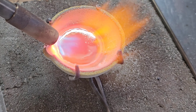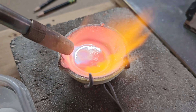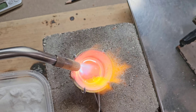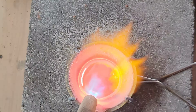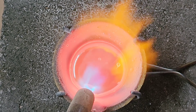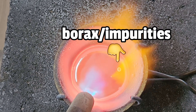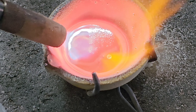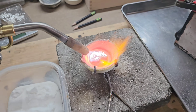Pretty much all the borax that you sprinkle on, along with that layer of impurities, will virtually completely burn off from the silver. You can see there's a little bubble of borax right there — that would either burn off, or when you pour this it might stick to the side of your crucible, but you won't have to worry too much about any leftover.